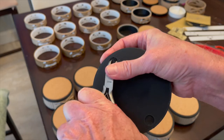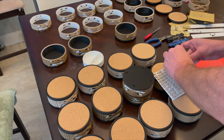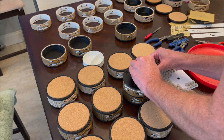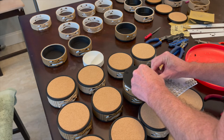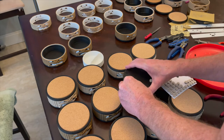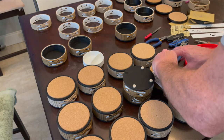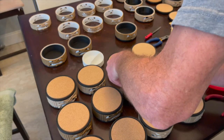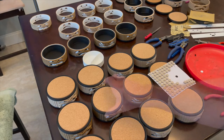I've got some little infill where I put in feet. I started out with cork — 2mm by 10mm round — and switched over to felt. I put a 10mm by 1mm indent in the bottom to hold those in place and give a target for where to put the feet. The cork was only sticking up 1mm, so I switched to felt, which is 3mm tall and gives a little more distance off the surface. The felt appears to be only 9mm wide though, so if I print more, I'll probably decrease the indent diameter by 1mm.